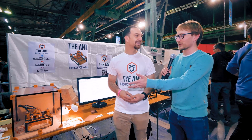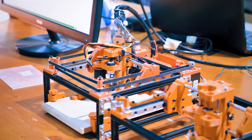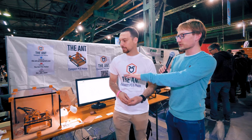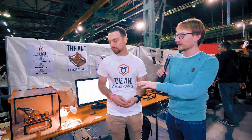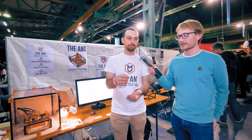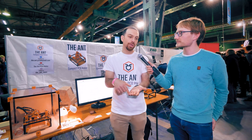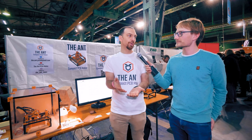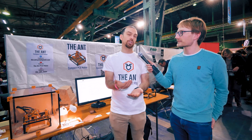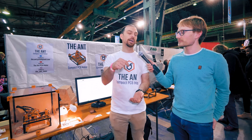It's basically a quadcopter brushless motor with Hobby King ESCs. The Z-axis motor is pretty tiny. For probing, we use open source software — bCNC — which probes a matrix of points and automatically corrects the G-code, giving us repeatability on the Z-axis as well.